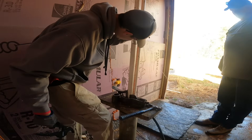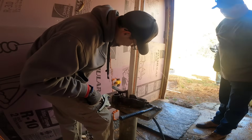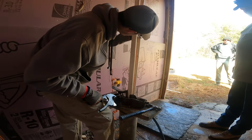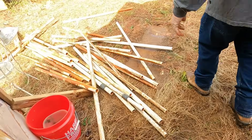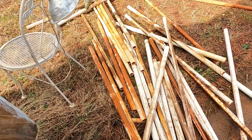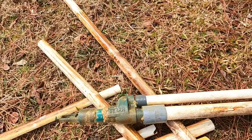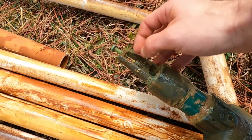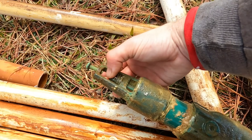It just does not want to cut. What's the year on that? Probably — I swear this is 1970. It wouldn't surprise me that they put this pump in and didn't even change the fitting at the bottom either. I think that pipe is from 1970. So we've got three couplings, which would be 60 feet deep. And this is what was at the bottom. It's amazing that check valve was still working, being that it was that old — barely working.